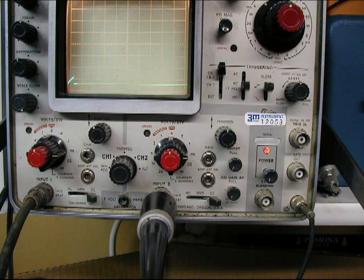It takes a while for a coil's current to reach its maximum. This amount of time varies a lot from one coil type to another. If we don't apply voltage to the coil for a long enough time, we won't generate the strongest spark that particular coil is capable of. If we keep charging it after it has reached its maximum, we don't get a hotter spark, but we do tend to overheat the coil, which probably will shorten its life. That's why we need to know the exact point in time for a range of possible voltages where the coil has reached its maximum current flow.